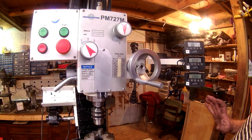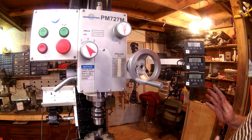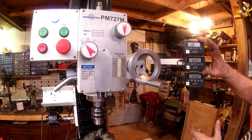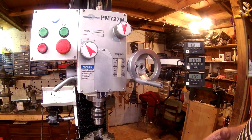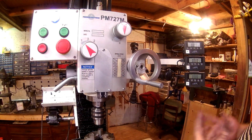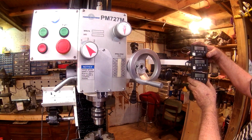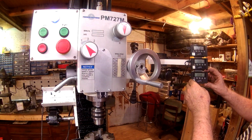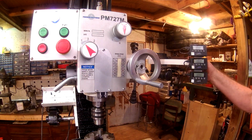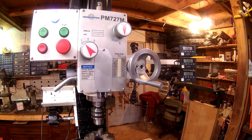It is a full DRO package, open source software, which if you're so inclined, you can get in and modify yourself, recompile. It runs on the Android devices, and it will be a display that will have X, Y, and Z. It also has capability, I think, for a tachometer, and has numerous built-in programs and functions. That will replace these three LED or LCD displays that are over here now, and will be a nice display, very easy to read, much larger than this. I've already got a mount made. I made this out of 1-inch aluminum bar stock. So hopefully that'll be coming maybe in the next video.